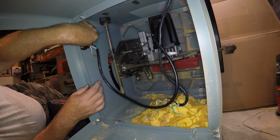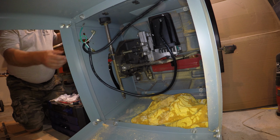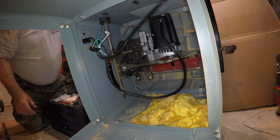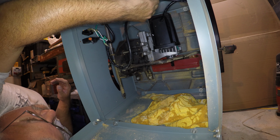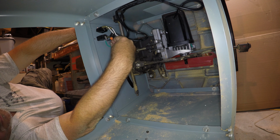And after that is done, I have to hook up the switches. So I'm routing the electrical wiring through the hole so I can easily wire it to the new switch. You can see there. And I'll also wire up the circuit breaker. And then I'll mount the switch by pushing the switch through the hole and pushing it far enough in that the 2 snaps snap it into place. And then I'll secure the breaker with a couple screws and put the cover on. And then we're done, and we get to test out the saw.